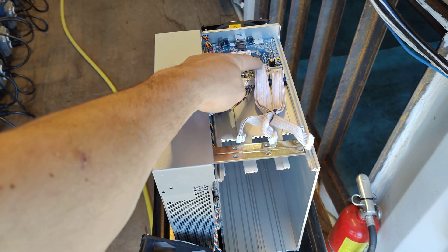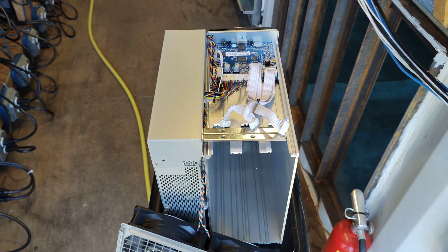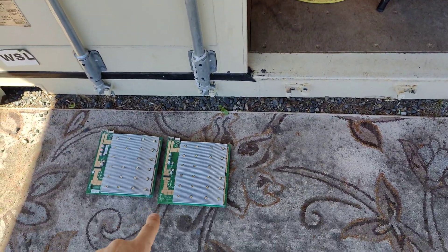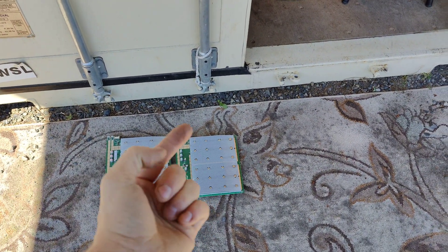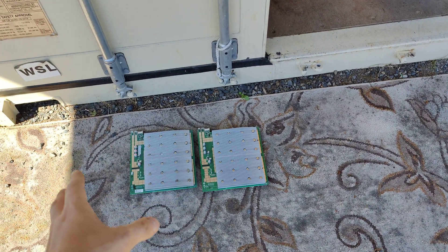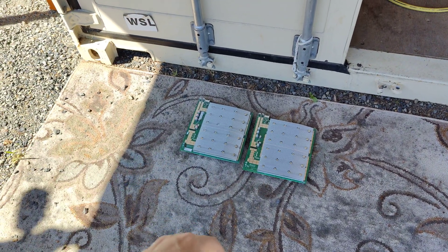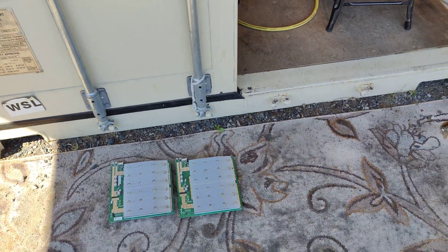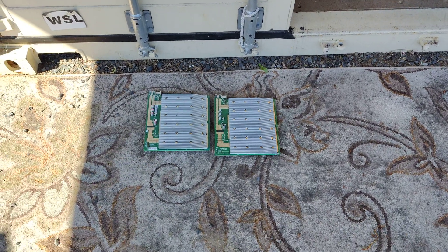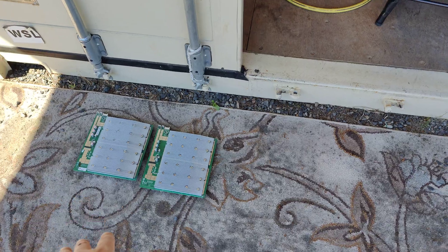This is slots one, two, and three — so before, we technically had just zero, one, and two. Plug those in, screw everything on, plug it in, and see if it starts mining, see if it actually detects all the chips — 114 chips. Sometimes there's a retry mechanism where if it doesn't detect them at first, it tries a different way, maybe changing voltages to detect them. We're going to keep an eye out to see if it detects them all right away, which is a good sign the hashboard is in good condition. If it's alternating between detecting and not detecting chips, or has to retry two or three times, that tells you something is probably still wrong with the hashboard. Based on our previous experience with S19 Pro boards, once they were fixed they usually always worked and it didn't break again — so it's a fixable issue.